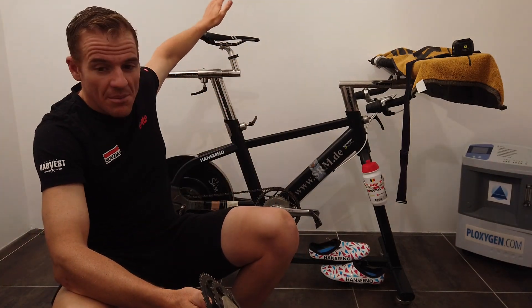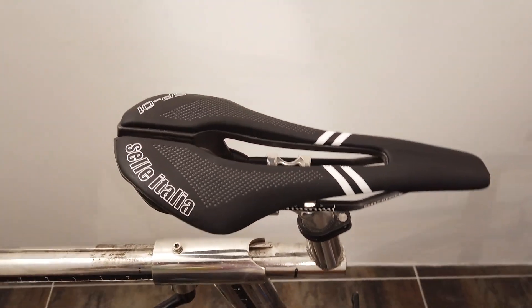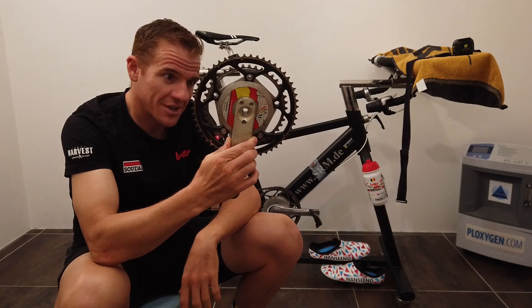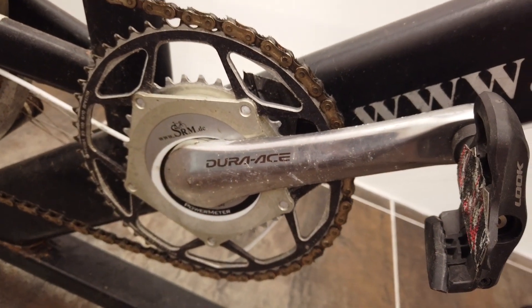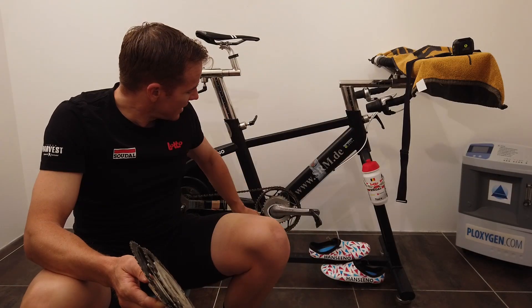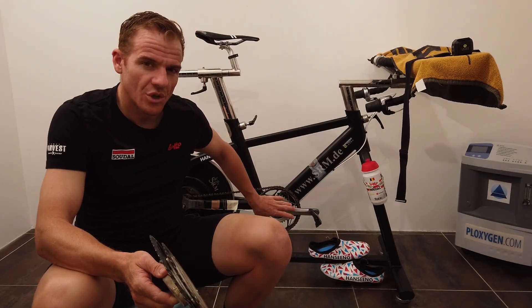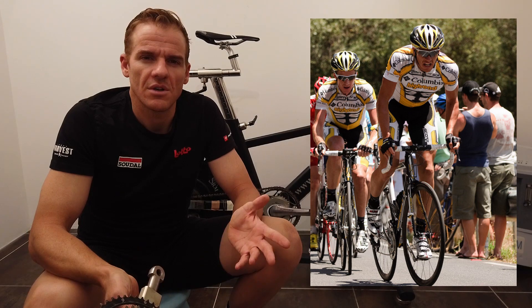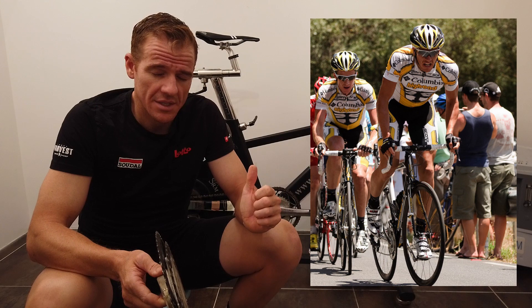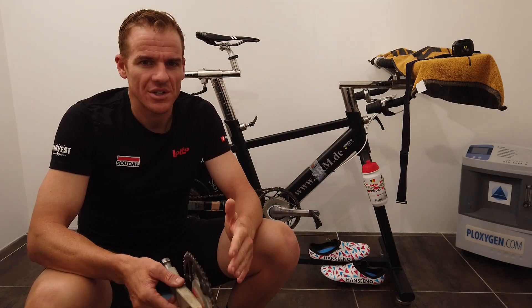At the back here I have my SRM bike with a trusty Selle Italia SP-01 seat - my favorite one. This crank here is a Dura-Ace SRM and it's my favorite design SRM ever did - I wish other crank manufacturers followed suit. It has a BCD to hold a 53 chainring so you can have a normal size outer chainring and the inner ring was compact. I used to race at HTC High Road with a 53 and a 35 - it was perfect. I could have a tight block at the back with gear ranges for everything. There are always moments in a race where you need an easy gear, and the 35 small chainring just covered everything with closer ratios.